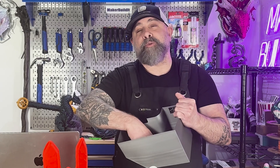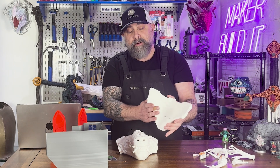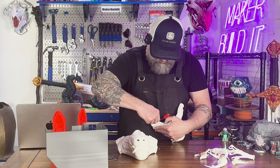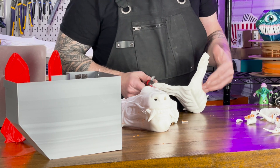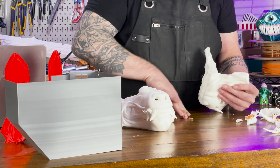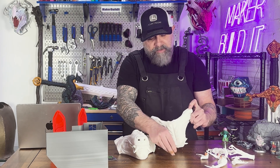Compared to the full PETG supports, this one wasted a lot less material and it still gave us a smooth, clean finish. And here I am getting sidetracked — I missed a support interface. Actually, that probably really helped separating that part with the PETG versus the PLA.